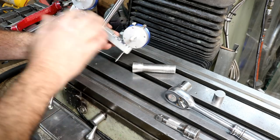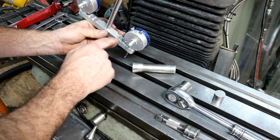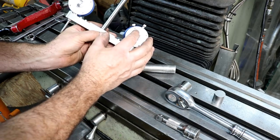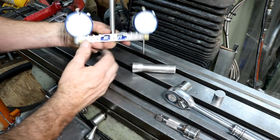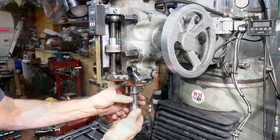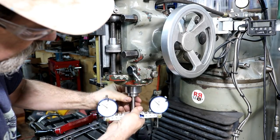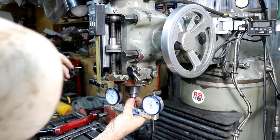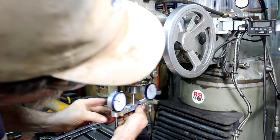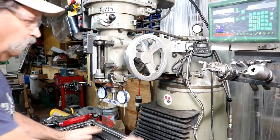Now this one's a little different than the other ones you see, other than the adjustment. He put these little ridges here so when the indicator sits right down in there, it's nice and square to the front. It doesn't matter which side they face, but it squares down. Now I have a half inch collet I'm going to put in here so I can spin it around.